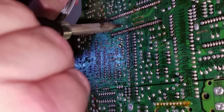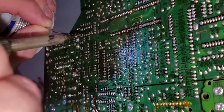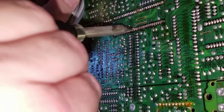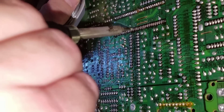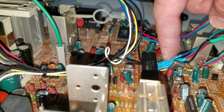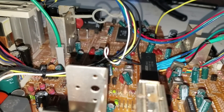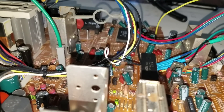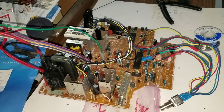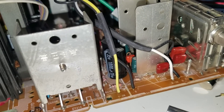When replacing something like this, you want to try to get above or below the pins so you don't bridge your connections. Just take your time — even if you make a mistake it's not a big deal, you can undo it. The new chip is installed with the lines running out and in underneath, and the chassis looks good. Let's go ahead and reinstall this in the tube and fire it up for a test.